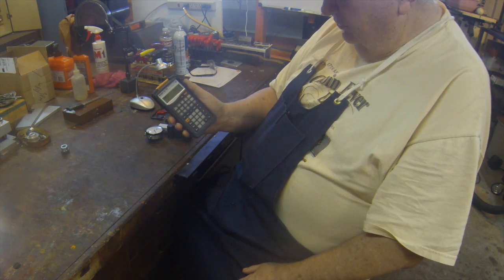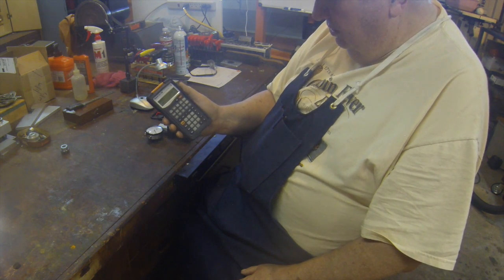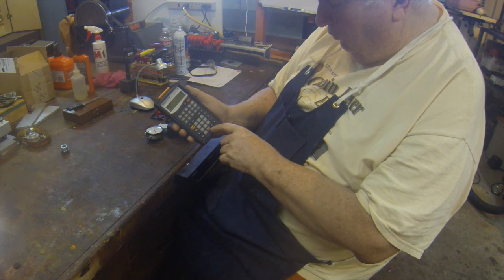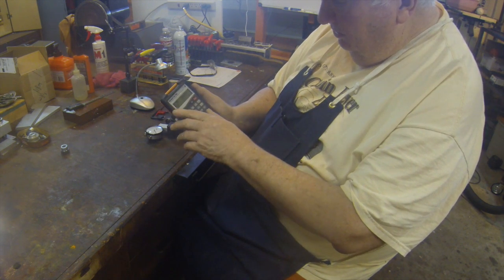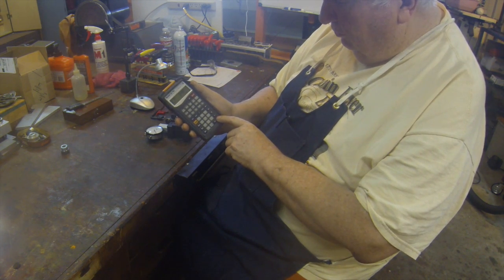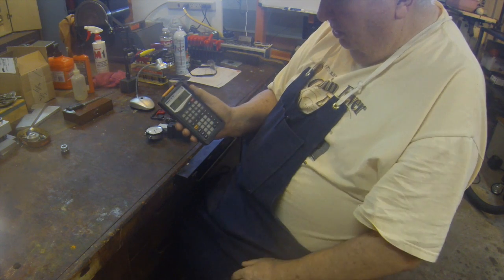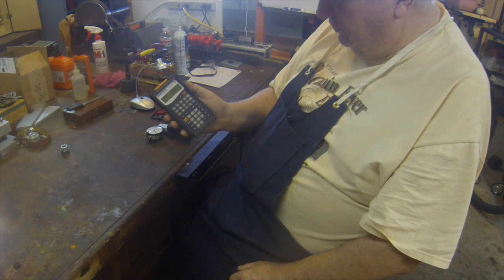And it does cut feed rates, RPM, working with various metals. One other thing is, let's say you wanted a hole that was let's just say 0.494. So you enter 0.494, hit drill size. There's a 12.5 millimeter drill, and if you say I want to go up from there, 1/2 inch drill, or if you want to go down, it's 31/64, 0.484. So for any size hole, you can get the nearest drill size on either side, plus or minus.